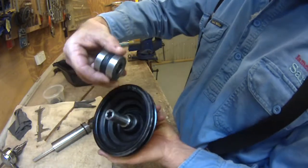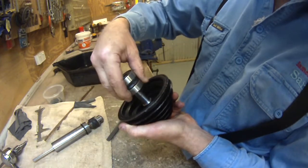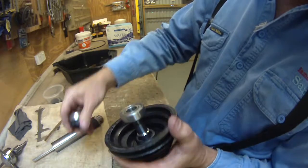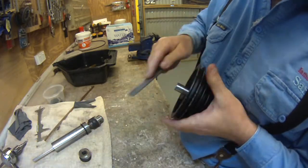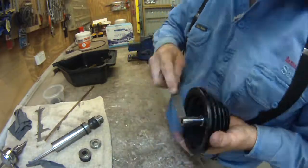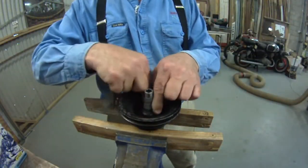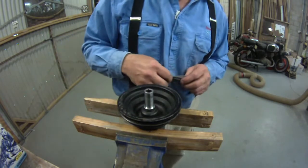These bearings stack up shoulder onto that, and then there's a snap ring that goes there. Because that was bashed up, I think this is mushroomed out a little bit — so I'm going to have to file it down a bit. It came apart easily when I took them apart, but not so much now. Maybe I've ruined that, but it's still a press fit — I can't get the bearing on here.